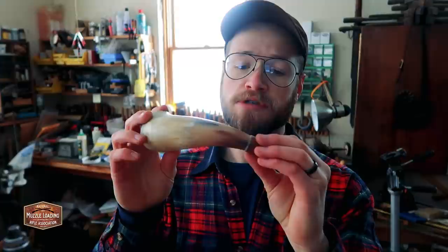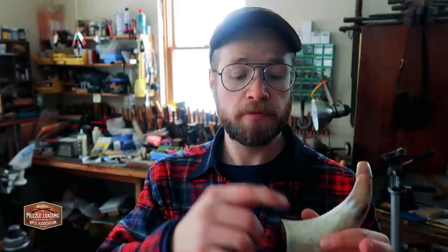After working the body of the horn some more and establishing our neck from our spout, I'm going to head down to the forge downstairs and go through the process of forging a simple staple for our plug to hold a strap. I'm going to wait until the staple is made before we drill and pin our plug into the horn so we can see that whole process from start to finish and not risk messing up the body of the horn. A lot of people suggest putting the pins in first after the plug is fitted and seated, but because we used epoxy to really seat the plug we have a little more leeway. So we're going to light up the forge and show you how to make a staple.